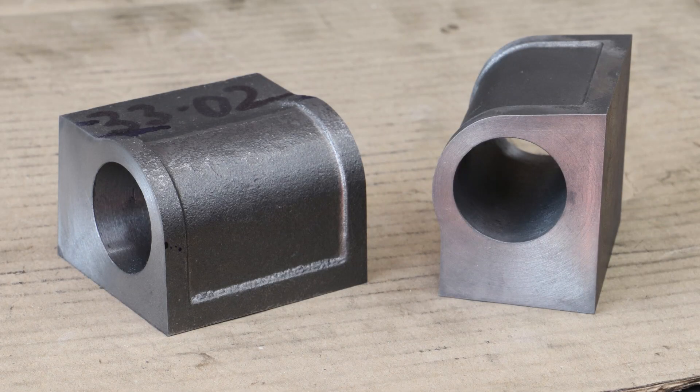Theoretically, if nothing else, I've got a pair of cylinder blocks for which the bores are parallel with the top surfaces, the steam chest faces, and both the front and rear faces are square with the bores. So on this positive note, I'll wrap up this short video and say thanks for watching.